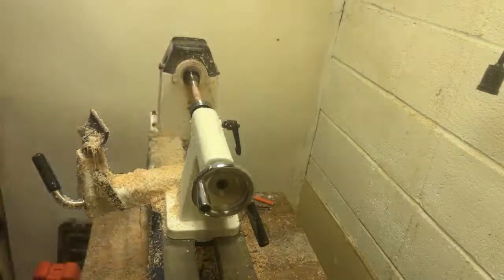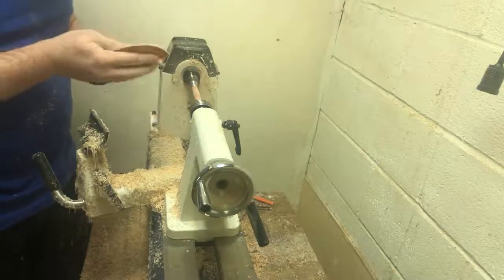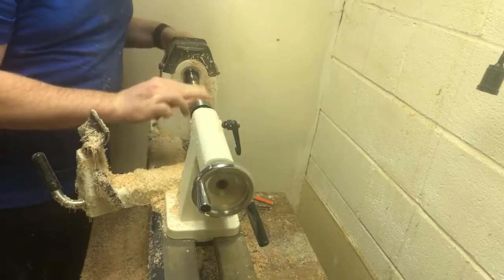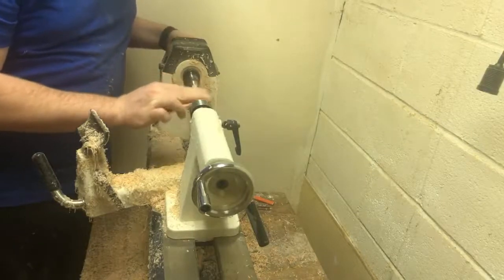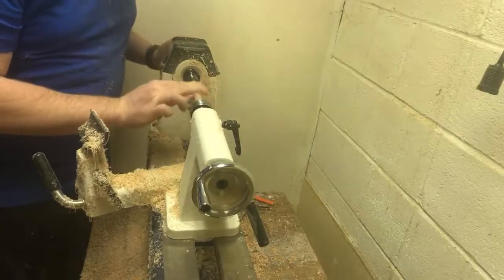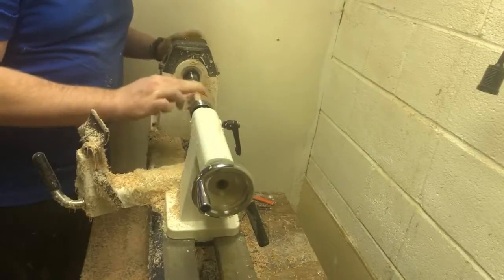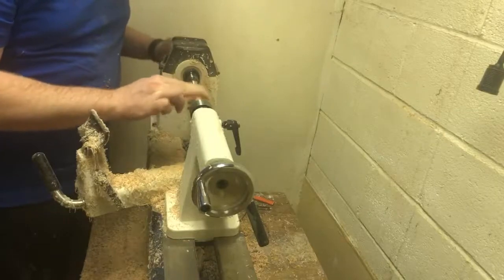All right, so what I'm going to do is sand lengthwise across the blank with the lathe off, and I'm going to rotate this slowly by hand just to change the swirl marks into straight scratch marks. Right now it's okay to have scratches in the blank because we're sanding. As we go through the grits, we will sand those out. We'll dry sand from 120 to about 400, and then we will micro mesh.